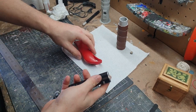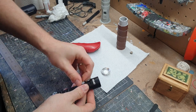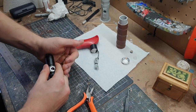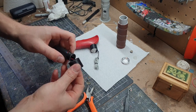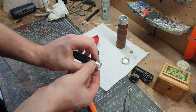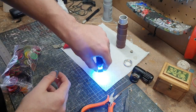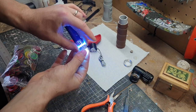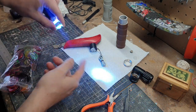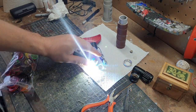The next thing to do is get the light section ready. This just simply pulls apart — there's my lens which I'll use later. I take out the button; I need to cut this in a few specific places to push out the section I need. It's quite a bright LED to create a nice lightsaber effect, and this will slot up into the lightsaber so you can charge it out through the bottom. I'll put the two lenses and a spacer together — those three combined at the right distances apart create a really nice beam that goes right up the lightsaber.